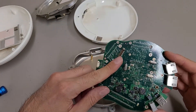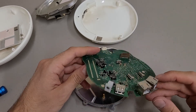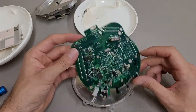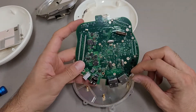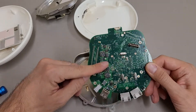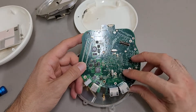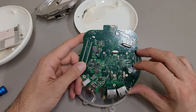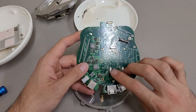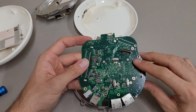There's not much to see on the bottom anyway. Looks like there's a connector there for something additional — I don't remember if these supported a modem for DSL, but it's been a while since I've messed with one of these. Got some power supply stuff there, some passives for the processor and memory. Not sure what these crystals are for — one is about where the processor is, and these two are right under the Broadcom chips, so it might have something to do with that.